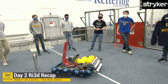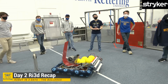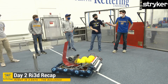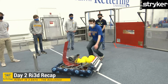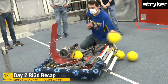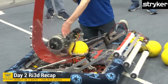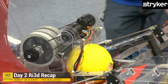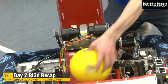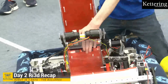Bonus day, why not? All right, last one's coming through on here from IDW Falcon. How do you prevent the balls from going into the shooter when you are not shooting? So currently, the balls are funneled in from the V-hopper, and they will rest right here. If you look at this axle, there is a 1-inch Versa roller that's powered by a bag motor on this side. So if we get a more heads-on view, you can see that they will rest on this shaft with this motor.